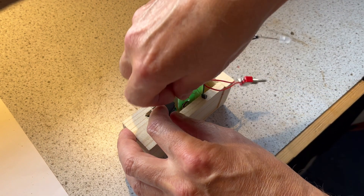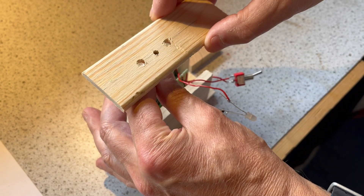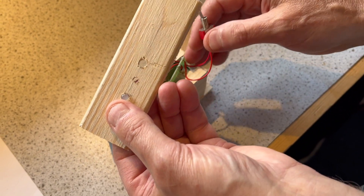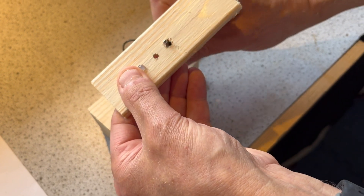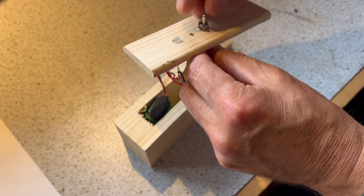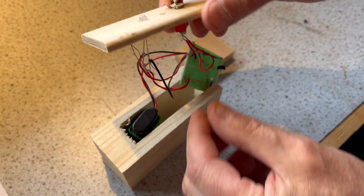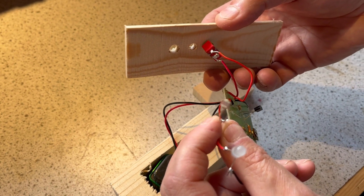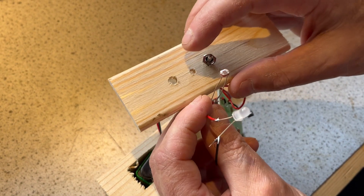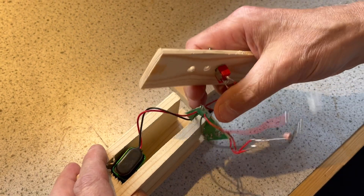All holes are drilled and the circuit fits inside. As I showed you in the first clip, all the components pop in there and poke through the various holes. The LED goes there — it's a colour-changing LED. The switch goes through there and has a little nut that tightens it up. I've got to take off the LDR here and solder it through so it's just poking through, looking flush on the top. So I'm going to desolder it and put it through so it holds all the various components neatly.